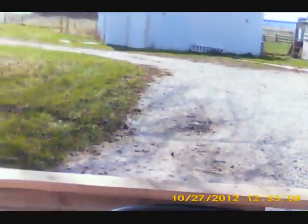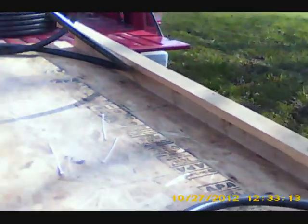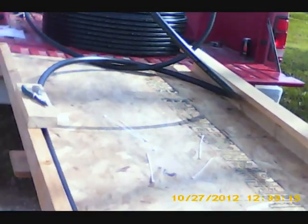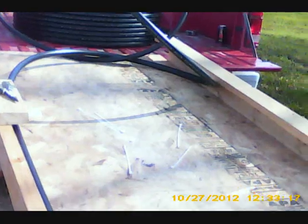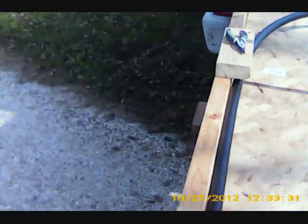I know lots of people have described how to make these tables — three feet wide, out of a full sheet of plywood, with two by fours bolted on each side. Notice that the other side of mine has got this lip, so that the slinkies don't come out while I'm working on them. This was a huge time saver for me. Before that, they were flopping all over the place. Notice the side I'm working on has got a couple of small pieces bolted to it with spaces between, so I can get in there and do the zip tying.